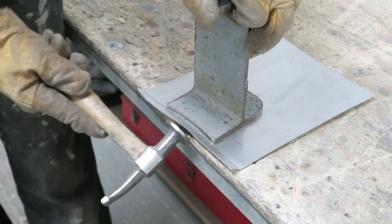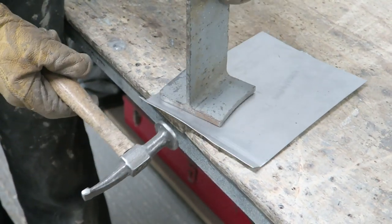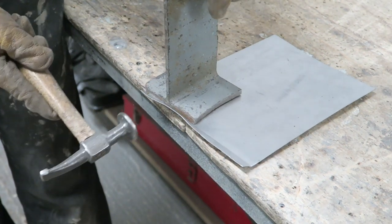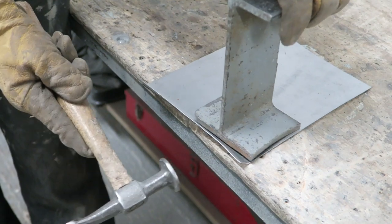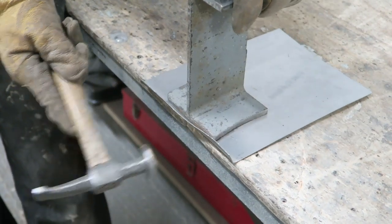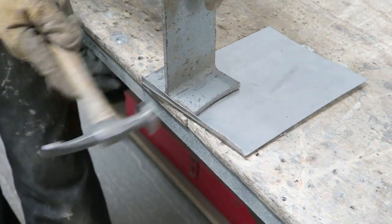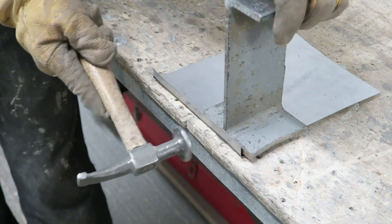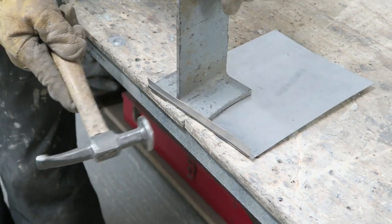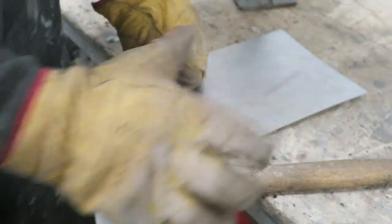So I'm now tapping it up. Now the second line, like I say, that was a curved die, so that second line is easily straightened out. This is a real neat trick, this is. If you haven't got a rollover bead, this is something that you can utilise on a cheap bead roller, just using a curved bead set against a straight one.